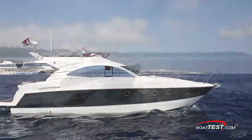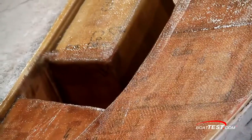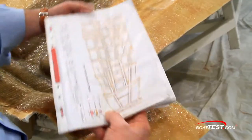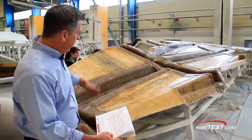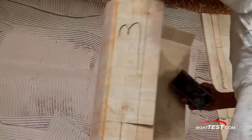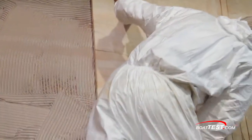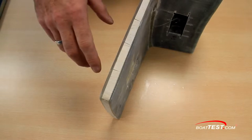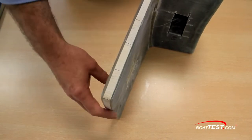As an example, for the hull and deck of the GT38, they opt for the hand layup process, where layers of differing pieces of fiberglass fabric are positioned inside the deck or hull molds and then saturated with resin. After this comes the application of the end grain balsa core, which is the lightest and strongest core material available. Beneteau chooses end grain balsa core, which provides the optimal strength-to-weight ratio. The balsa is cut into rectangles, which allows the resin to completely encapsulate the balsa, stiffening the structure and preventing the spread of water intrusion should there be a puncture.